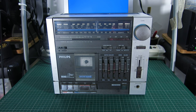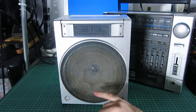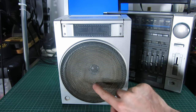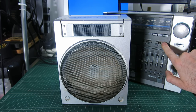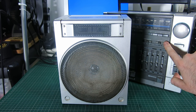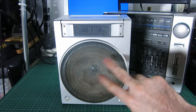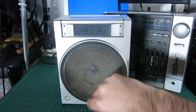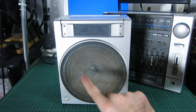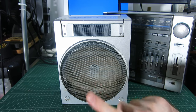Something else I want to mention on the speakers: the front grille of this at the top — they're plastic — has a kind of cloudy grey mottled finish. This is supposed to be dark grey, basically the same colour as the faceplate. Over time it goes cloudy, much like old plastic car bumpers. It may be something to do with a mould release agent. These do come apart — there are two screws at the bottom and then the back of the cabinet just hinges out. The driver isn't fixed into the front; it's held in by a sort of metal spring. I treated it with a cotton bud soaked in bumper restorer — back to black — and then washed and cleaned this grill with a toothbrush.